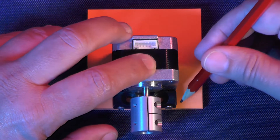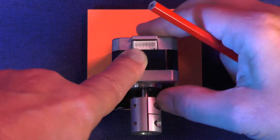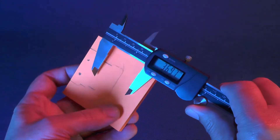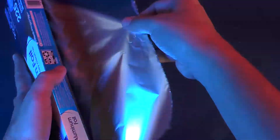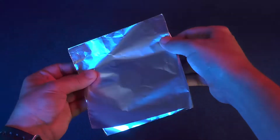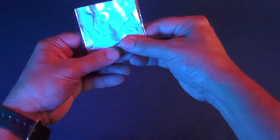To begin with, we need to create a template of the stepper motor with the screw holes. We don't need anything high-tech here — just a post-it and a pencil where we can draw around the stepper motor. Our spacer should have 37mm of width by 44mm of height, and we are going to build our spacer out of aluminum foil. We need to cut out a square sheet and begin folding until we get close enough to the right size, and most importantly, to the right thickness. Our spacer will have a great advantage over a 3D printed spacer: since it is made out of aluminum, it will help dissipate the heat from the stepper motor to the aluminum frame of the printer, and it is a material that is in every household and very easy to work with.